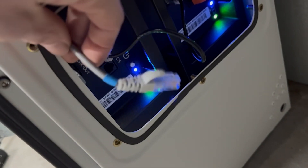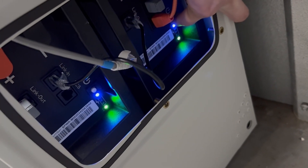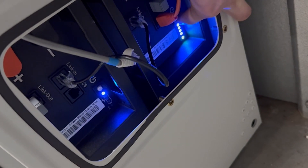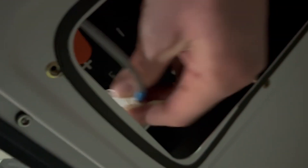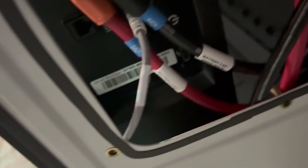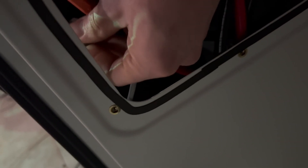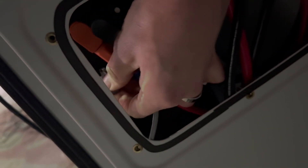These have lights. So what I'm going to do is turn these off. I heard everything click off. I'm going to pull this Terminator plug from battery number two, install a cable that runs from link out up to link in on this third battery, and then the Terminator plug goes into link out of our third battery — if I can get it in single-handed, I'm sure I can.